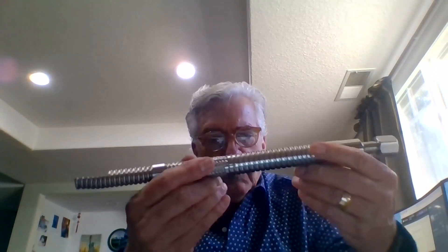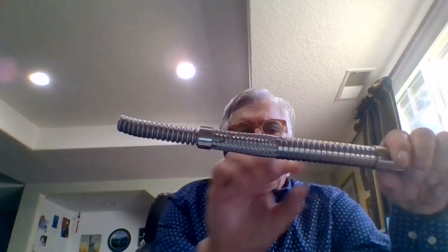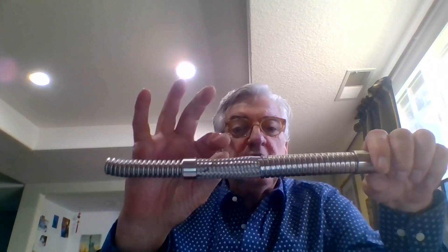This is a liquid transfill hose with the corrugated center and braiding on the outside for pressure-carrying capacity, and then armor. I recommend getting armor on every hose you buy, whether it's vacuum-jacketed or a standard liquid transfill hose. What's different about a vacuum-jacketed hose is we would take another layer and go over the top, then weld it on and pull a vacuum on the annular space between the two walls.